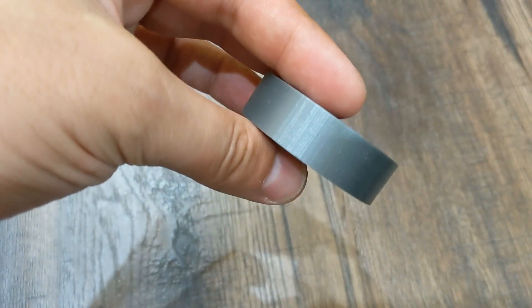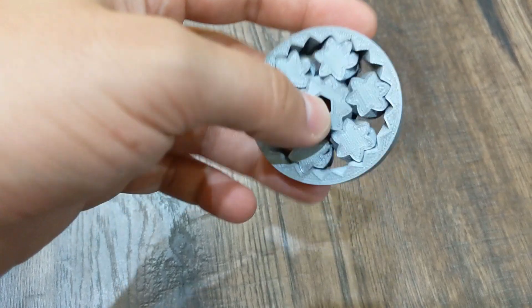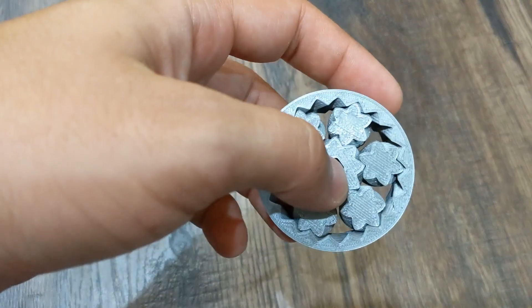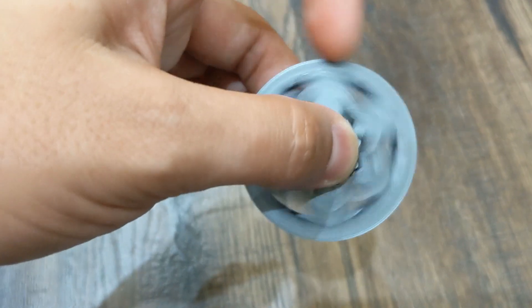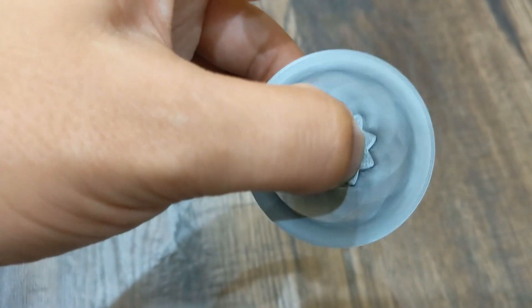After the whistle I wanted to test something more complex, something with moving parts. This is a planetary gear bearing that is printed pre-assembled and can be manufactured only through 3D printing. This print took around 2 hours with 0.2 mm layer height. The print is perfect and as you can see the gear bearing spins very well.